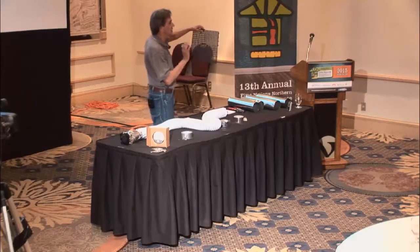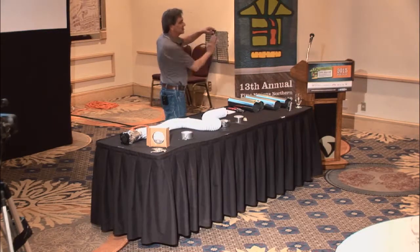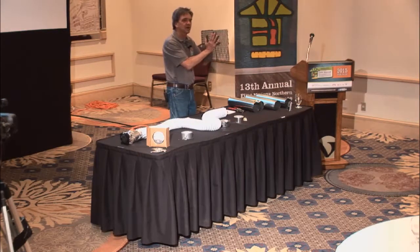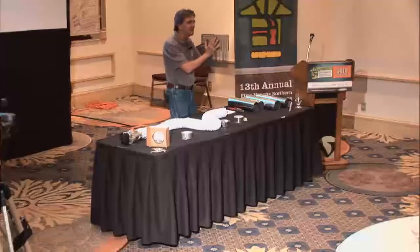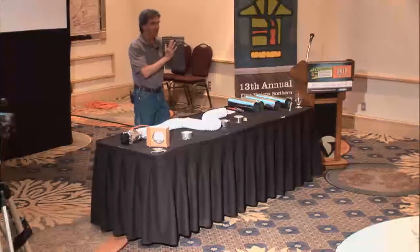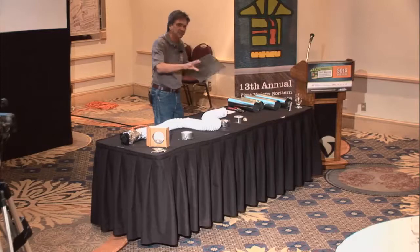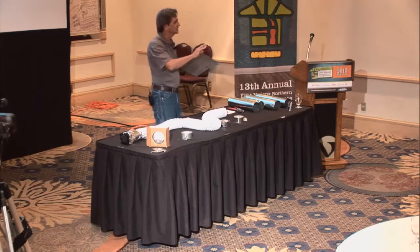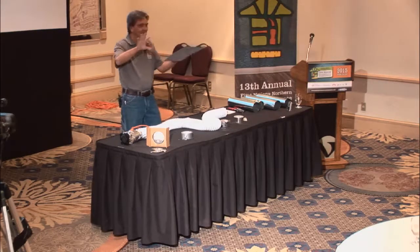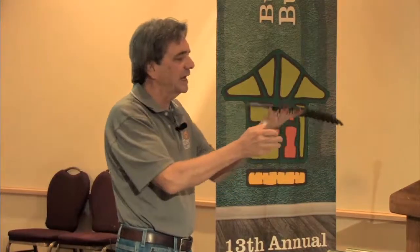But by having this, one, it's a capillary break. We don't have a direct connection between wood or cardboard and the concrete. But there's actually a little air circulation here. I've gone into cold storage rooms where we've had problems on the walls, and I've glued these to the walls. I filled the walls with these things, and then they put their stuff in. You try to tell them, leave a space, they don't do it. So they shove it up against, but they can't get to the concrete.